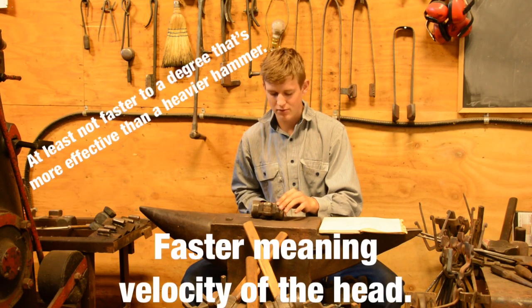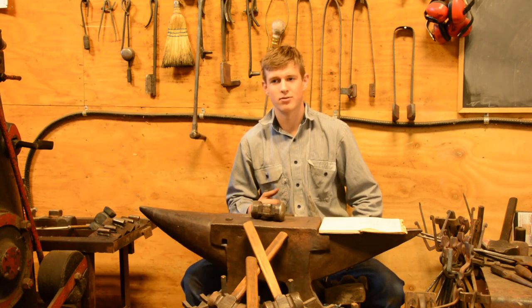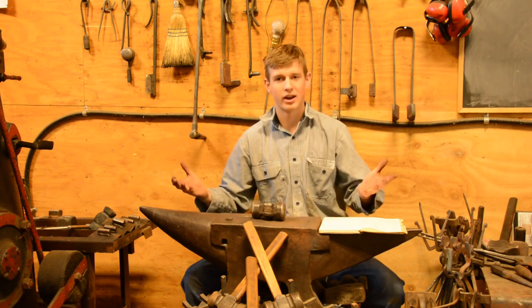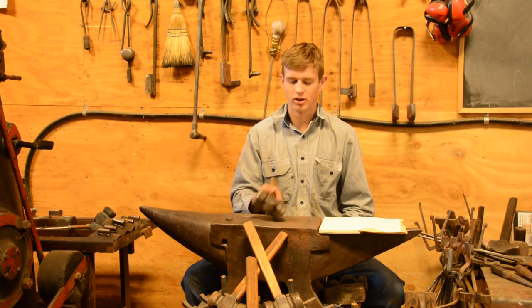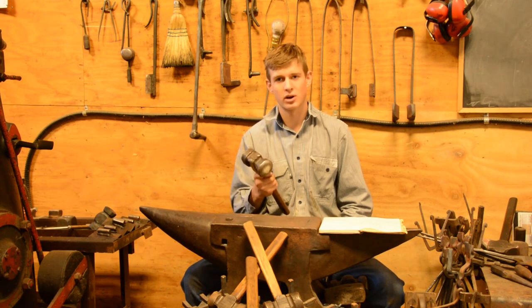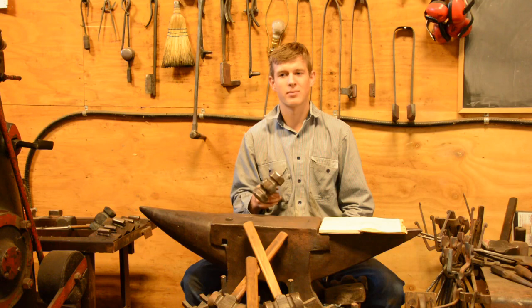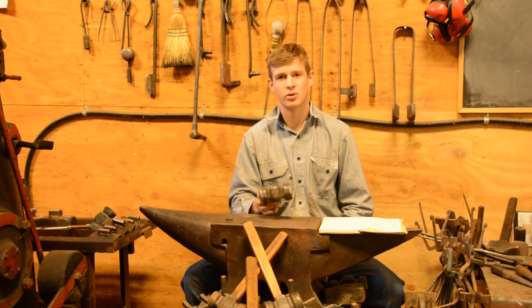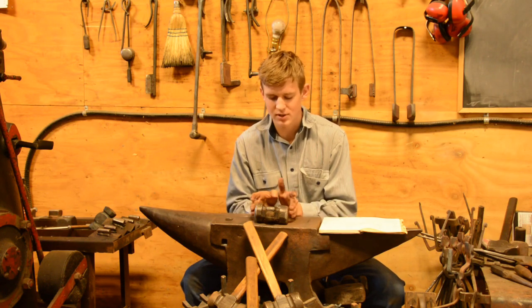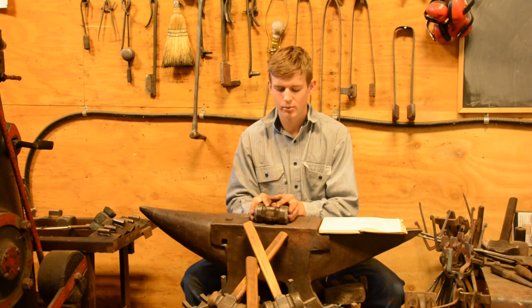And so for the type of work that you see people like me doing if I'm hand forging, or the other chain gang members, or Brian himself, or his students in general, that's why they're generally, especially if they're doing big work, using big hammers and choking up on them. It's very easy to swing them that way, but they have more inertia because they're heavier and you can get more work done. And just generally, because the head speed is slower, there's less shock in your hand. I would recommend trying that.